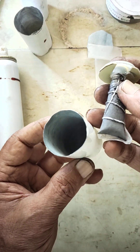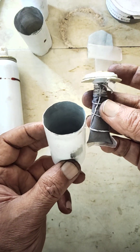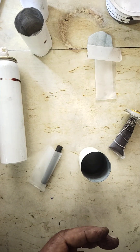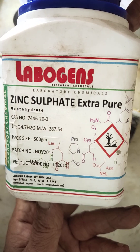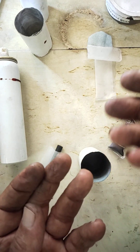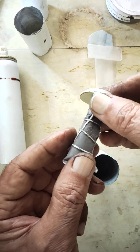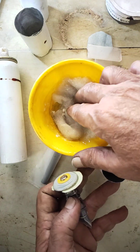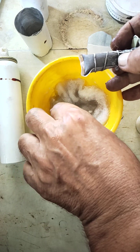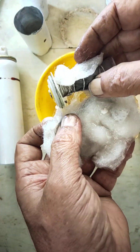This is the positive electrode. The aluminum can which I have cut and coated with zinc will be the negative electrode — these two are very vital. For the electrolyte, I am going to use zinc sulfate as the major component and manganese sulfate. Zinc sulfate will make a gel electrolyte. This electrolyte is important because it allows electrons to pass between negative and positive, so current will develop.